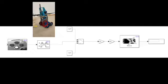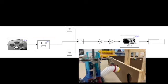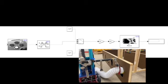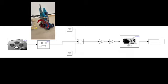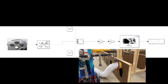Gripper claw that is controlled by the 7 down button on the controller. It uses a servo to open and close. Similarly to how the motors are controlled in our double rack and pinion system, when 7 down is pressed, it sends a value of 1 or 0, which is sent to a switch block that sends the servo a value of -127 or 127, depending on if it is receiving a signal of 0 or 1.